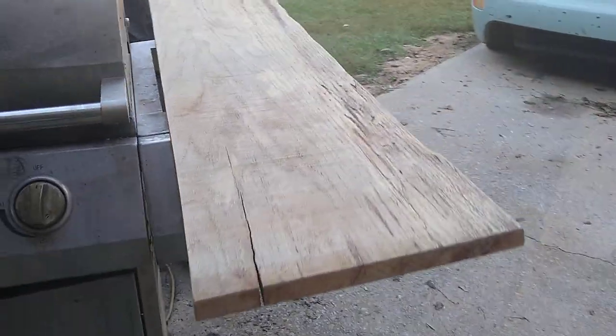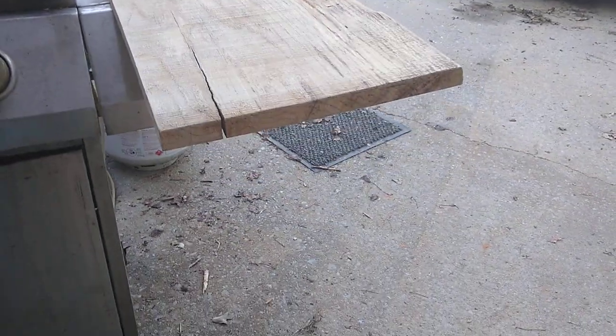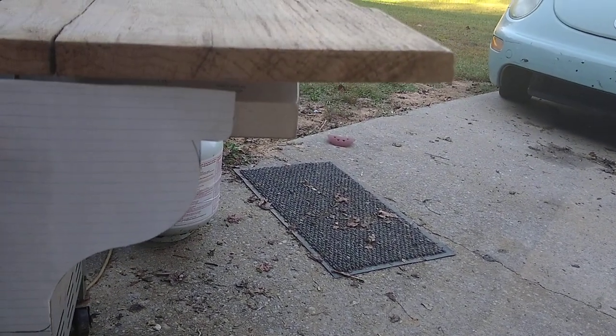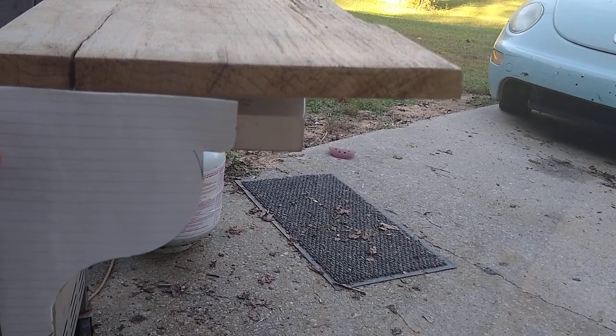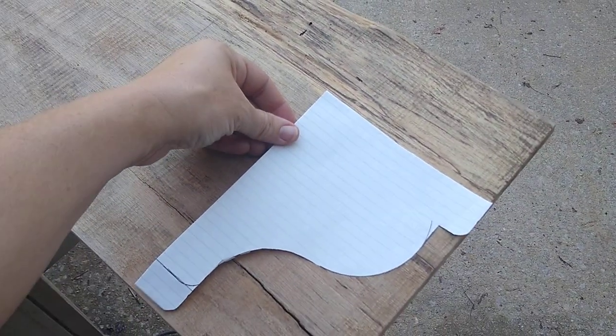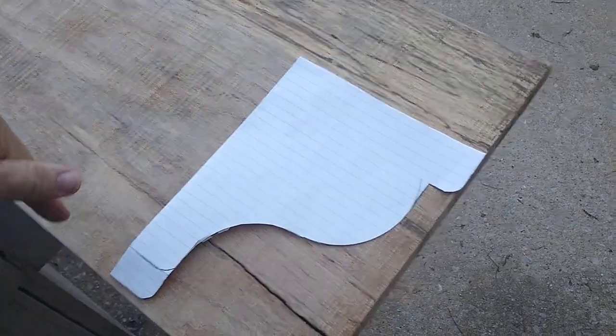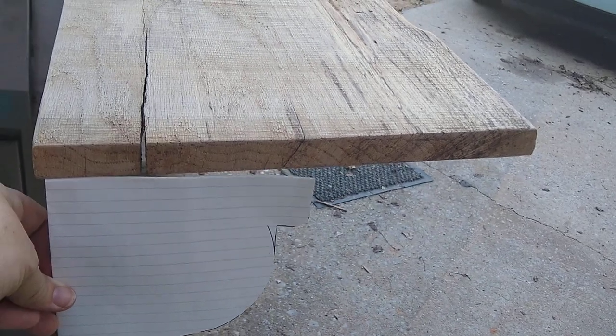I have my shelves — I've been sanding on them all day. If you don't have an eye for how big your corbels need to be, this turned out to be roughly one half of the width. And when I lay it up here, it's about two-thirds of the top. So if you wanted to measure, just measure two-thirds up and one half on the side — that gives you how long and how wide to make them.